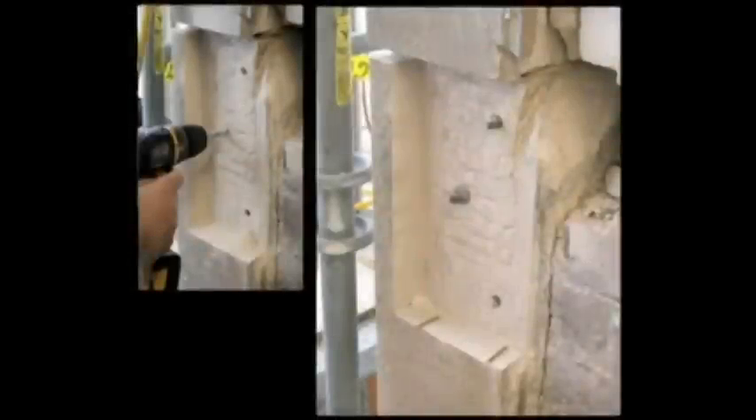A series of one-half inch holes are drilled in key locations in order to place a three-eighths inch threaded stainless steel rod to receive and reinforce the replacement stone. The rods are set three-quarters of an inch in exposure to receive the matching holes drilled in the replacement stone piece. The stone dust is captured from the drilling process to be used in the natural hydraulic lime material formulation for attachment of the new stone piece.